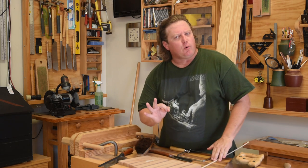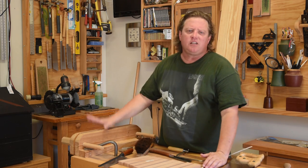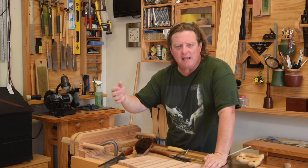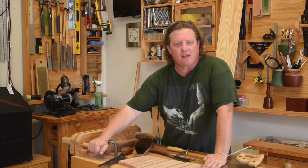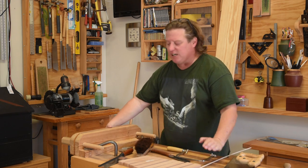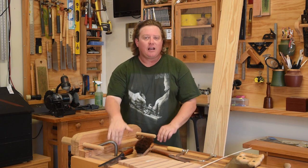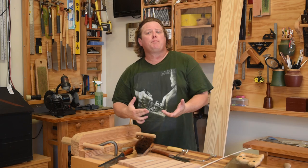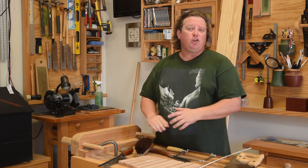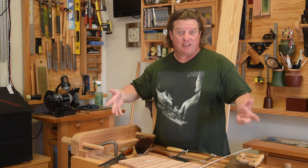The main clamping tool we're going to be using, though, is one of my Moxon vices. Now, this is nothing spectacular. This one right here is just made out of construction lumber. But if you don't have a means to make threaded screws and stuff like that, you can just use those blue quick clamp vices, because all this is a free floating board clamped to another board that's clamped to a table. So with two boards and a couple vices, clamps, you can make this and use a picnic table, or if your wife or mom will let you, your kitchen table.